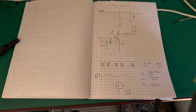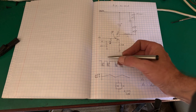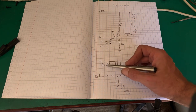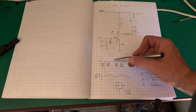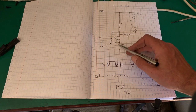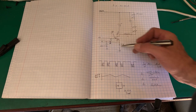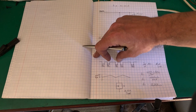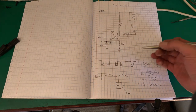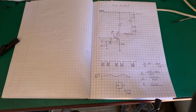The chip that they've got in here is actually very easy. It's a constant current LED driver with a fixed off time. What that means is that the off time over here is a fixed period. What will vary to give us more current, that's why we have this current sense resistor here. As more current flows through here, the voltage on that side will build up and go back to that IC. The IC will make this pulse width longer or shorter, depending how much more current it needs to drive. Obviously that will be based on its pulse width modulation.